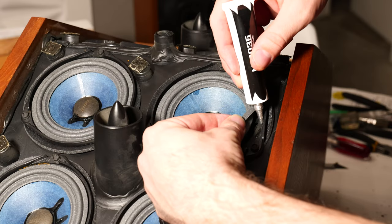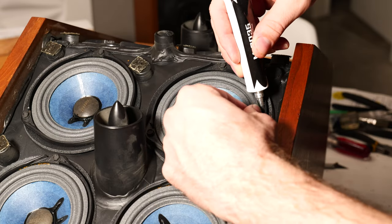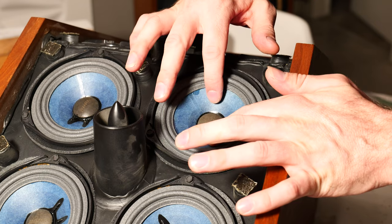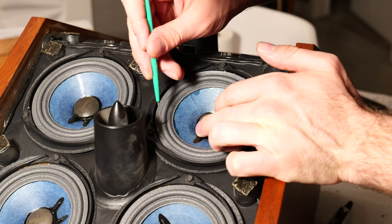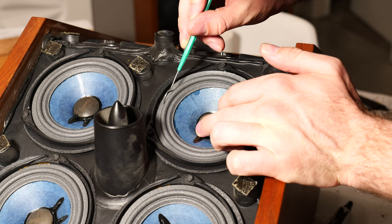The biggest thing I found about the gluing process was that having the foam surround permanently stuck to the cones made centering the voice coils almost entirely unnecessary. Of all 18 speakers, only two of them needed a little nudge to be centered. I think that was partially because they're small and light, so the spider was able to automatically center the coils on its own. To be clear, that's not the spider that laid the eggs — the spider in this case is the springy bit attached to the voice coil.